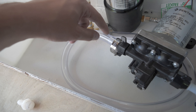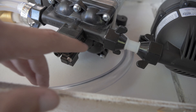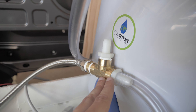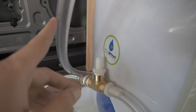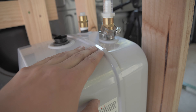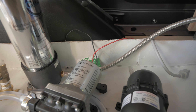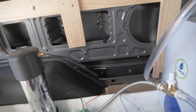It circles all the way around into the pump. The pump will pump the water through the accumulator — you can see the little arrow right here. From the accumulator I'll come up to this other T-junction. One end of the T-junction will go to this ID tubing that I haven't plugged in yet because I probably want to make some adjustments to it — to the hot water tank, and the hot water tank will run to the faucet. The other end will come through this compression fitting down to the water filter, and then from the top of the water filter also up to the faucet.